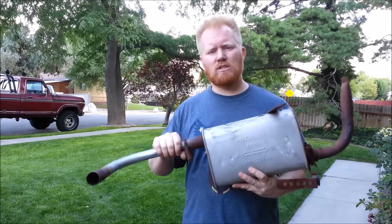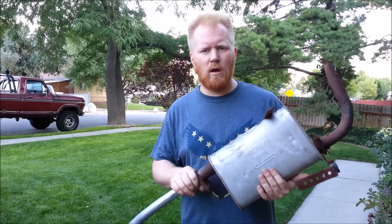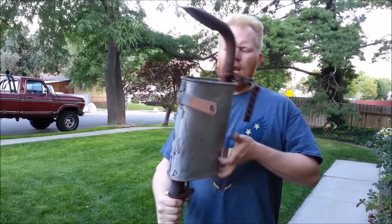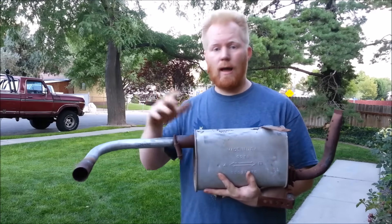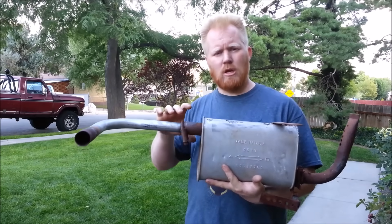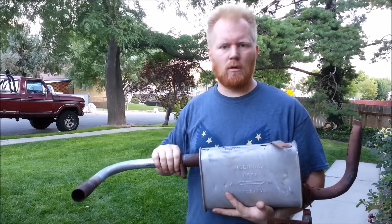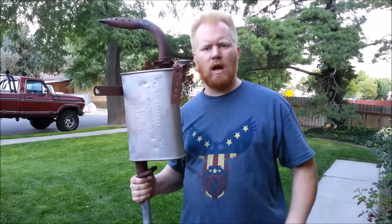What a muffler will do is change the frequency. So even though something's just as loud, I'd rather hear a dull droning versus a high-pitched squeal at the same decibel - that's what a muffler will do. It'll reduce the decibels by one or two, but it'll make it sound lower. My good friend BC Truck does a video where he puts an absorption muffler - a glass pack. They're not louder; they really aren't. An absorption muffler is actually a really nice thing - it absorbs the sound in the fiberglass material and it'll last forever on a generator. I'll put a link to his video down in the description.